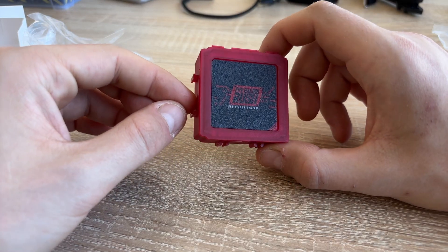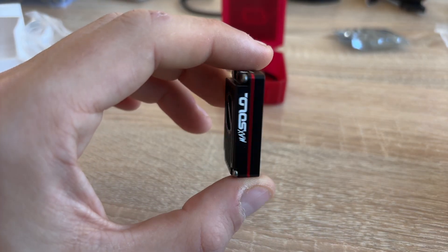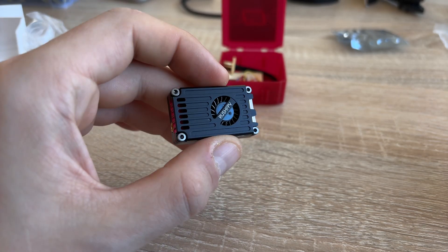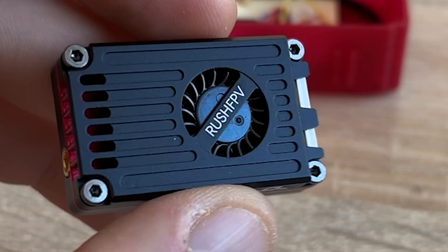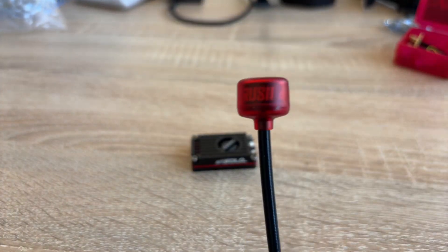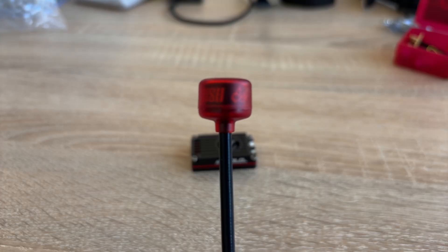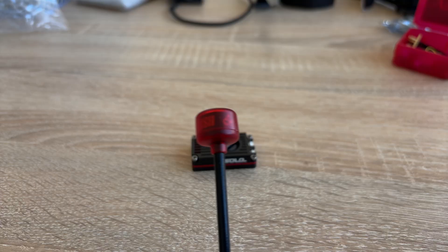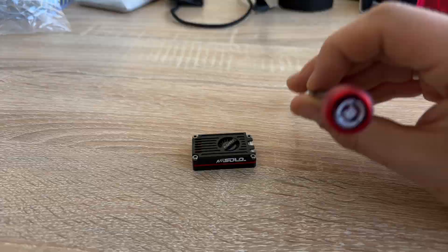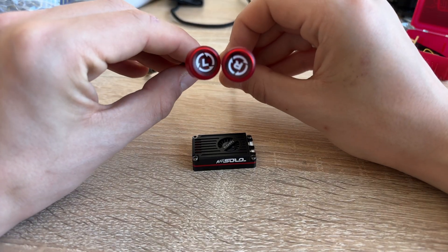If you don't want to lose your drone, I recommend buying a good video transmitter. My personal favorite is the Rush Tank Max Solo. It has 2.5W of power, which is critical for long flights. As a bonus, it has a cooler inside which may be helpful in summer. You also need an antenna — Rush Cherry antennas are good, especially the second generation. I recommend buying the longer version since it won't create interference and will always stay above the battery, giving you better signal. Since we are using analog video, consider choosing one with right-hand polarization.